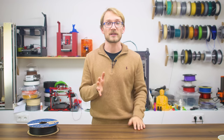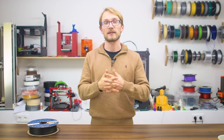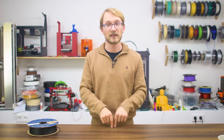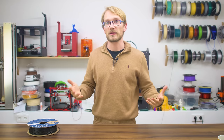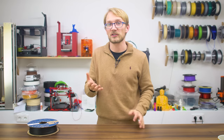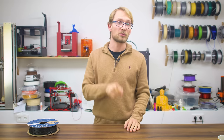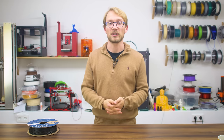This was unexpected. As it stands right now, if you need stiff, high tensile-strength parts with excellent heat resistance and don't mind the extra step of annealing them, plain old PLA might just be the perfect material for that. Of course, this is just a single data point — there might be other downsides, like a higher tendency to crack over time or faster degradation in wet environments. If you decide to try annealing parts yourself, leave a comment below on how it went, and if you've got any other tips to share, don't hesitate to let me know.